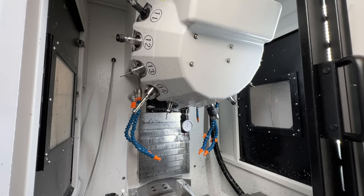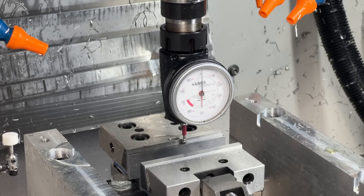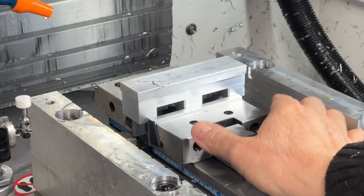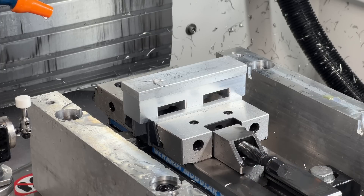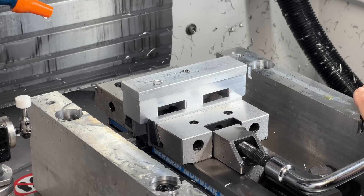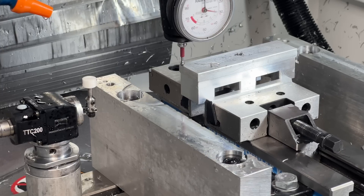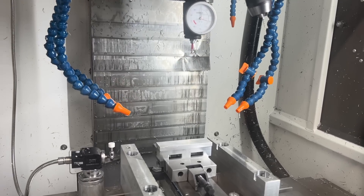For the next setup I've got G55 at the bottom back centre of the part, so I need to set a zero in the Y axis at the face of the rear jaw and the Z axis at the top of the step. It's probing time again. I know I'm probing on the raw face of the stock, but it's a non-critical measurement — I just need to be roughly centred. If I was doing this properly, I'd probably have used a longer end mill and machined the whole of the end faces for a precision fit.